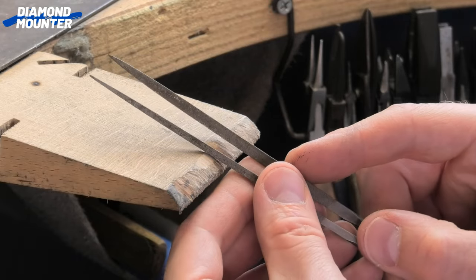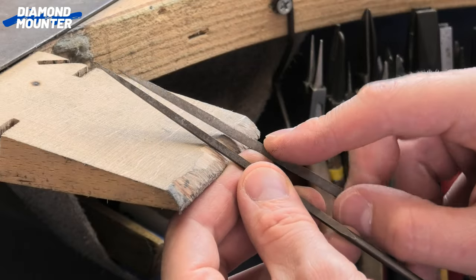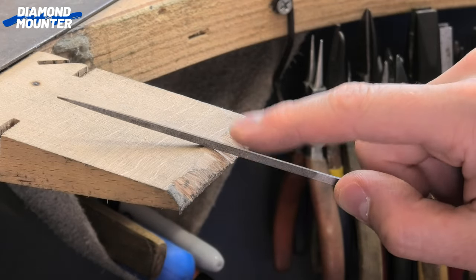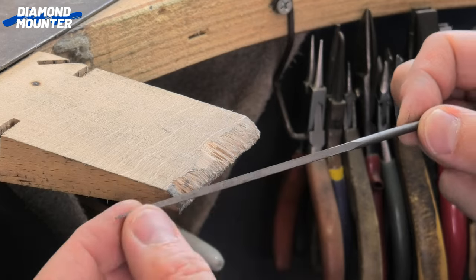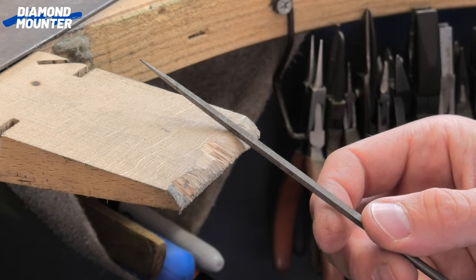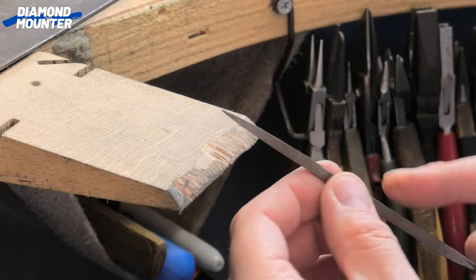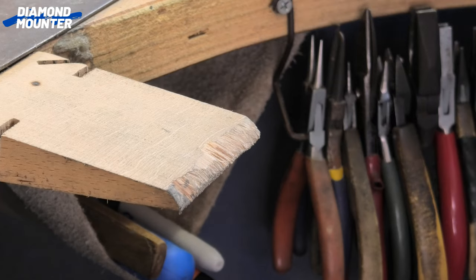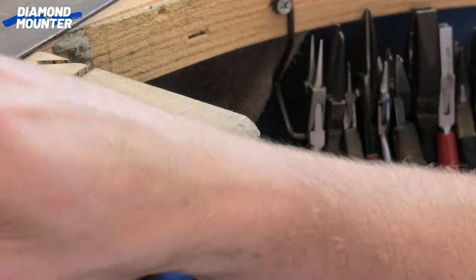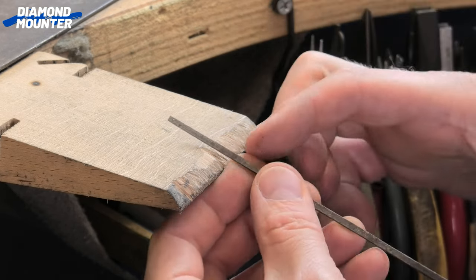One complaint I've made in the past — you've got square and you've got tri-square, the three-sided one. The ideal file doesn't exist. I want the right angle of a square but with a flat down one side so you can push hard onto it comfortably. When filing you're quite often filing little V-shapes into metal, pushing hard with one finger right on the corner — that's uncomfortable. There's no reason I can't just get that on a grinder and grind a flat on it. If these are made by jewelry tool manufacturers, they should know we are often filing little V's into things and create tools accordingly.